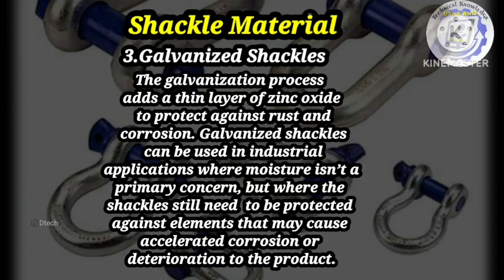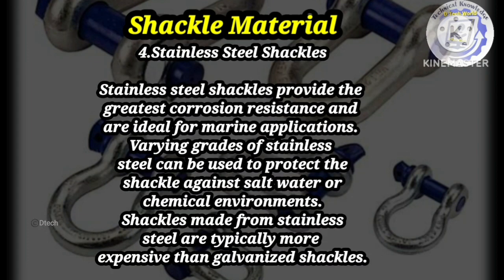Galvanized shackles. The galvanization process adds a thin layer of zinc oxide to protect against rust and corrosion. Galvanized shackles can be used in industrial applications where moisture isn't a primary concern, but where the shackles still need to be protected against elements that may cause accelerated corrosion or deterioration to the product. Stainless steel shackles provide the greatest corrosion resistance and are ideal for marine applications. Varying grades of stainless steel can be used to protect the shackle against salt water or chemical environments. Shackles made from stainless steel are typically more expensive than galvanized shackles.